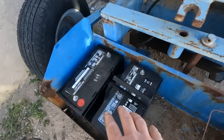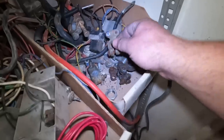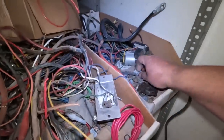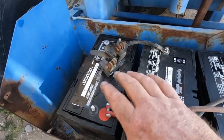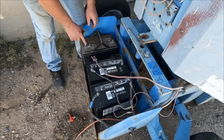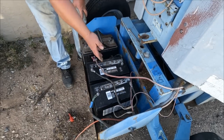Just a little bit of debris. I was worried I wouldn't remember how to hook up those batteries, but I wrote myself a diagram when I pulled them out — so we're all set. I couldn't find the adapters I need to go from one terminal style to the other. Only one battery needs the top-post style, then I remembered the deep-cycle battery I already put in the bus — it has both bolt-down and automotive-style terminals, so I can hook these straight up. Luckily these are all going to be in series, so it doesn't matter if it's a different battery.